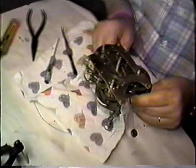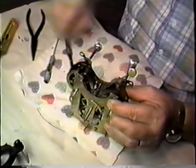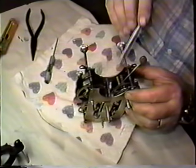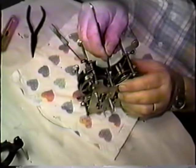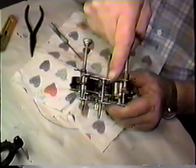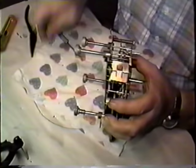Now those two little springs that we had when we started, you got to put them back where they belong now. And you tweezer around. Get a hole over with your tweezer, bring it around, and lay it on the top of the plate. It locks. That gives you your tension on your hammer. And then the other one that was on the top, that's for your lifting lever. So we'll put that one in position. It's only a very small one.